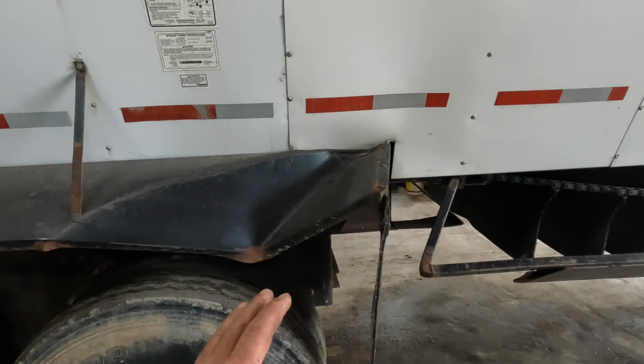Okay, so we have this tarp all just about ready to roll out and latch it underneath the latch. We do have fasteners to hook on to go through the actual winding bar. I haven't got that back far enough, but we've got the tarp centered on the trailer. All of the saddles have been hooked back onto the smaller pipe that holds it over to this right-hand side of the trailer. So we'll wind this out. We've got to get that winding pipe back a little farther. It's forward a little bit farther than it needs to be. We need to get it unrolled over to the left side of the trailer. So we'll go ahead and roll it out, and then we'll get that pipe centered to where it has to be. And then we're probably going to have to retime that crank handle.